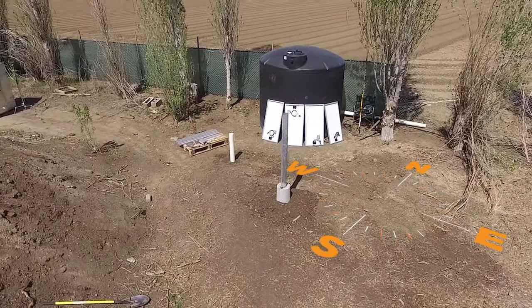First thing we're going to do is take our poly pipe out of the blue packaging and get our drop wire out and extend it out in this field. This is going to allow the pipe to heat up — pipe is a little bit easier to handle when it's warm by the sun. If you don't have a sunny day, you can still handle it while it's rigid, but getting it laid out helps get the coils out and makes it straighter and much easier to drop down our well casing. Once I have it laid out, I'm going to pull out the submersible pump and do our splice and plumbing connections.